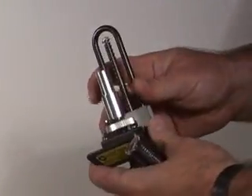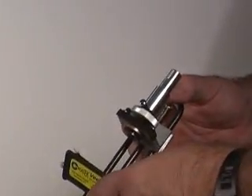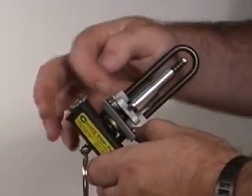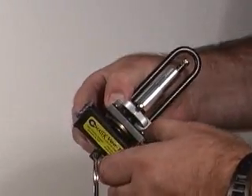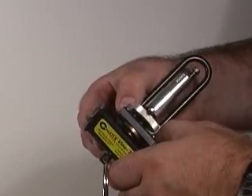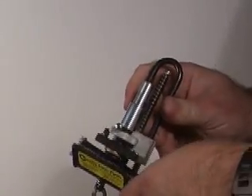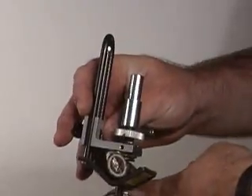Once that's locked — once you set the depth of cut — you no longer need to change your depth of cut. Another feature of the tool is it has a spring-loaded blade adjustment here. If the cable's out of round, it'll pick it up. When you put the tool onto the cable, push down a little bit so you can press that spring. Simply make sure the cable is secure, being squared to the bottom of the V.